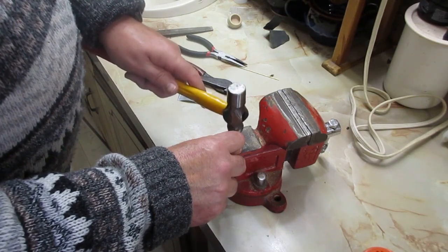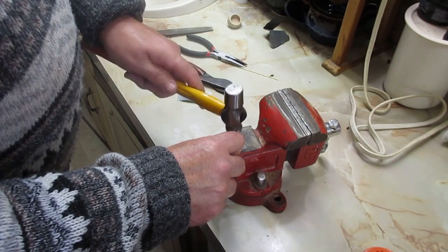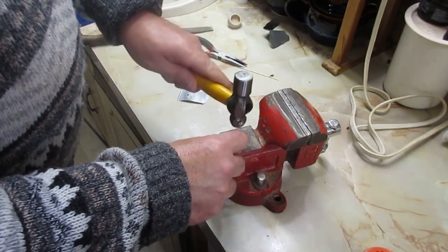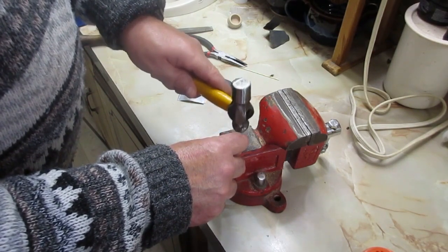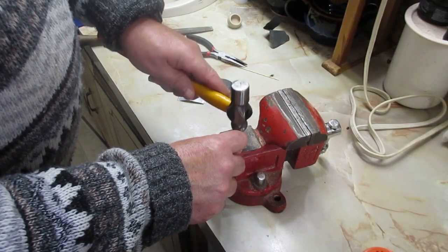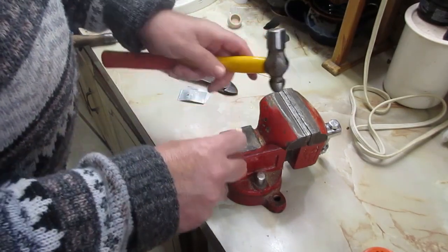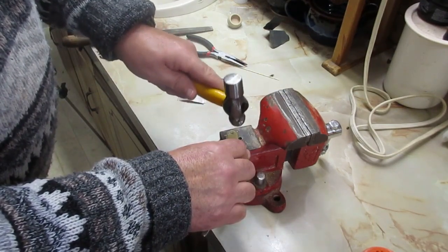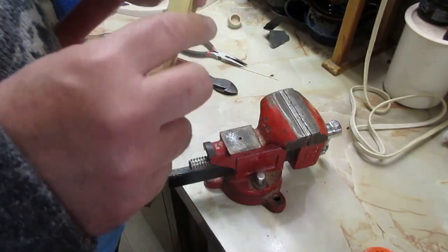And you notice I'm tapping, I'm subtly moving this ball peen head in sort of a random pattern around and across and, you know, side to side or whatever. What I'm doing is I want it to peen evenly. And I want it to be round. But I can kind of feel with the pad of my finger when these two are close to the same.